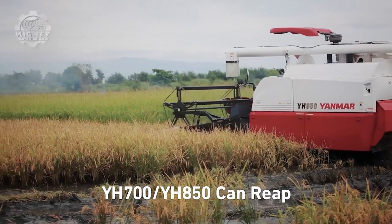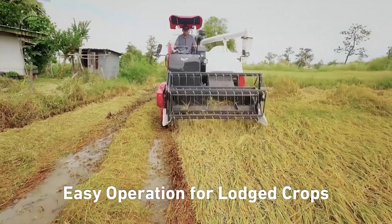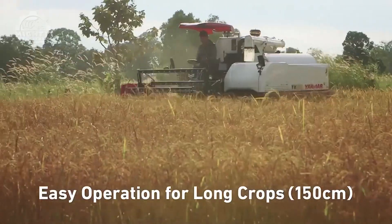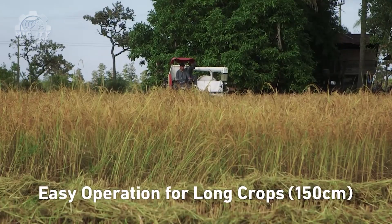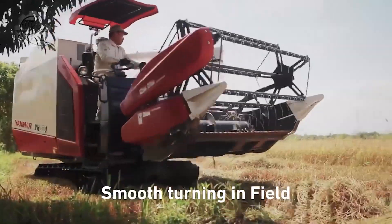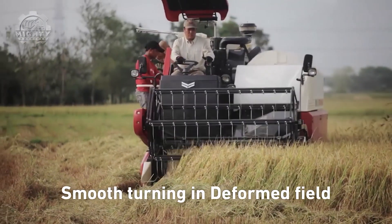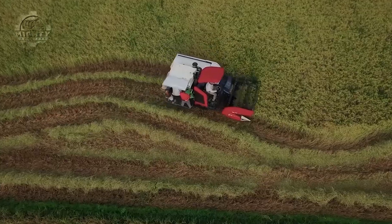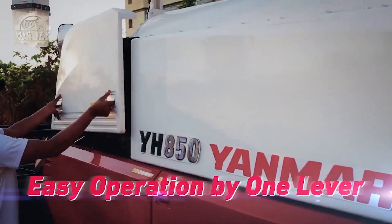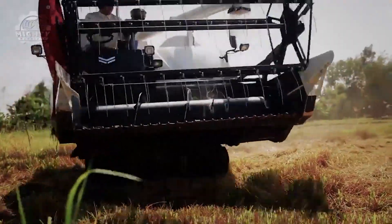Second, it is powered by a powerful engine that not only allows high-speed harvesting with lower fuel consumption, but also has a large swing separator which allows high-speed and efficient sorting with low grain loss. It also has a large fuel tank capacity able to consume 115 liters for 15 hours, eliminating time lost to refueling. The Yanmar YH-700H50 also features Smart Assistant, a service that monitors machines based on data for operations and conditions utilizing GPS equipment installed in the machine, effectively improving farm management and overall efficiency.